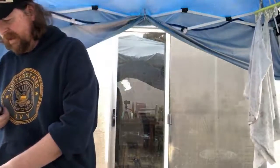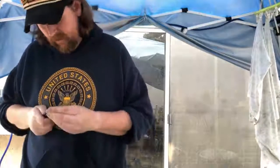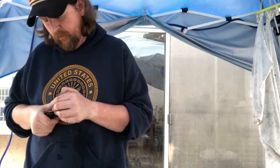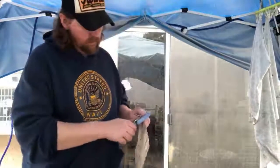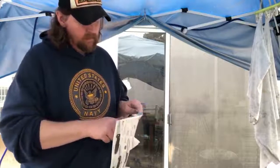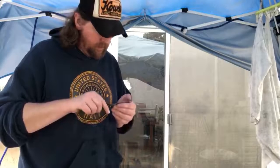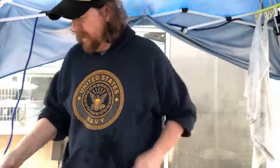But I actually think that this 12,000 is better. I really do, because it is super mirror polished, but it's also freaking nightmarish. It's a completely different finish than any other stone I use. I haven't even stropped that yet. It's got a couple catches in it, hiccups, where I've got to strop out some stuff and then clean up that forward apex.